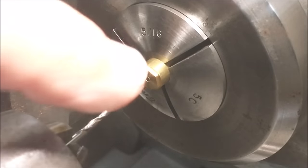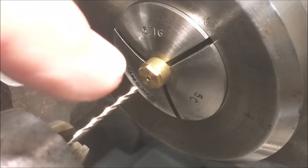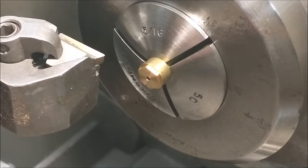At this stage I'm going to take this piece of brass out, measure the overall length — that's going to be my real working dimension. Knowing the overall length of the slug, the counterbore in the back is simply that length minus what you want to achieve the feature. If this is 0.500 long and I want a 0.100 screw, I'll make the counterbore 0.400 deep. And only because if I thread it and then counterbore it I risk crushing the thread on the inside of the arbor, it's always better to put the thread in last.